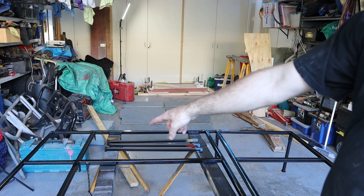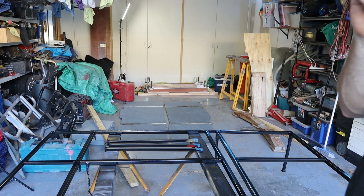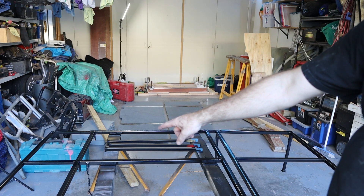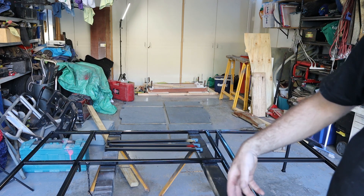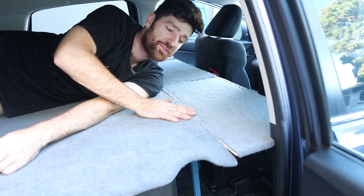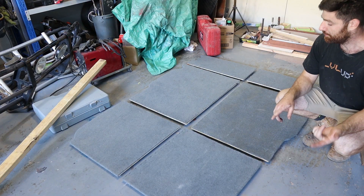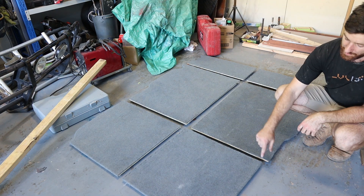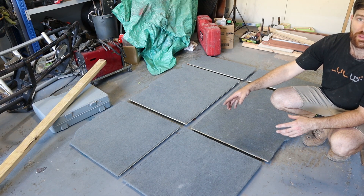There are two long legs on the outside, a medium one in the middle, and four short ones on the end. I've got the telescoping extension that slides in and out of the frame, and then a bolt on a piece of chain — that bolt is just a locating pin and it's welded to the chain so I'll never lose it. Some of the plywood is a bit curvy because it's so thin — I just got unlucky with the piece. With all these panels I used contact adhesive and it worked out a treat — just follow the instructions on the can. I've wrapped over the edges where they meet the plastic, but where they meet each other there's no carpet to interfere.